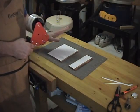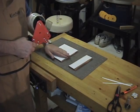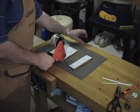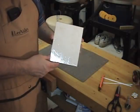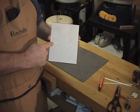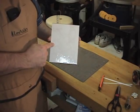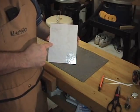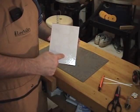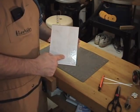Just like in the previous videos, I'm going to cover the pattern in clear box tape. The box tape helps lubricate the scroll saw blade and cuts down on burning of the wood. Especially in this cherry, it's a really good idea — cherry really has a tendency to want to burn. I have the pattern completely covered in the clear box tape, and we're going to take these pieces to the drill press and drill them out.